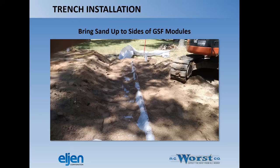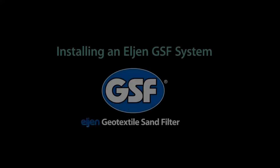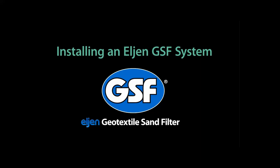So you're going to bring the sand up around the sides, like you see there. You're going to cover, seed, and divert water from the system. So it's nice to mound it a little bit, just so water doesn't rest in the system. You're going to want to backfill it a little higher than anticipated, so when it does settle, it's not going to create a depression. Quick video, and I'll just let this roll.